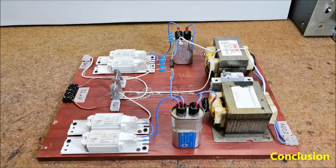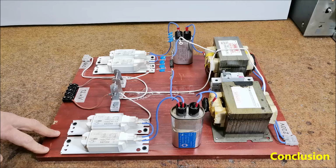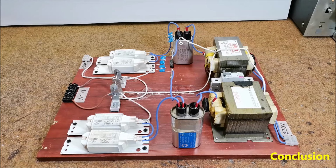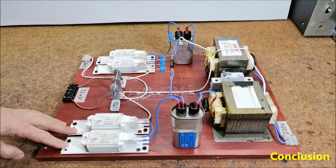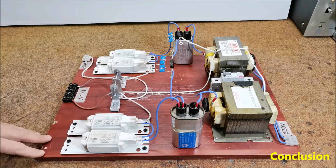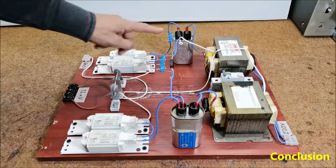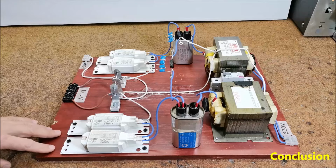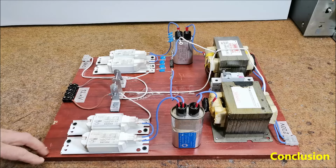As you can see in the video, with this high voltage power supply and other TC components with a short tuning, I was able to achieve a spark length of more than 50 cm. The fluorescent lamp is lit at a distance from the transformer of 2.5 meters and more. During the first shots, as a precaution, I did not let the transformer work continuously more than 20 seconds. Then I tested it with continuous operation for 1 minute and more, and the diodes were completely cold. I only had a problem with excessive heating of the spark gap due to the higher value of the current.